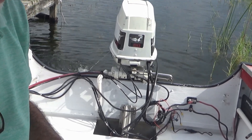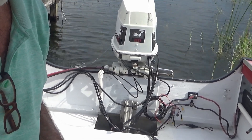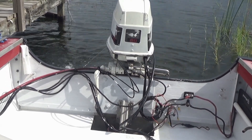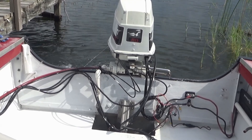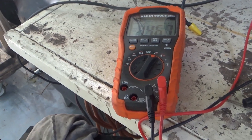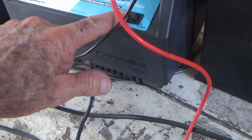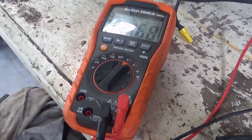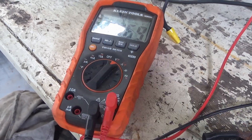It works with that cable — just needed a little charge, thank god. I'm still considering two batteries, at least when I want to use the trolling motor. I put a pretty big dent in it trying to start it on those loose nuts. The battery charger is putting out 14.68 — a little while ago it was at 14.88, now 14.67. I've got it on manual — let's see what happens if I flip it to automatic. It went up a little bit. I just want the fastest charge at this point. It's been on all night and it was low.